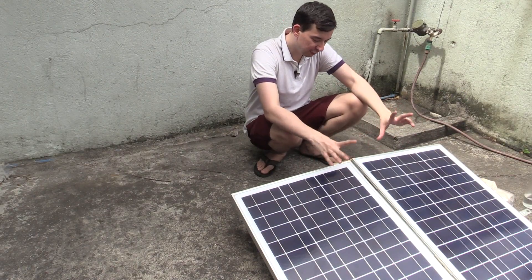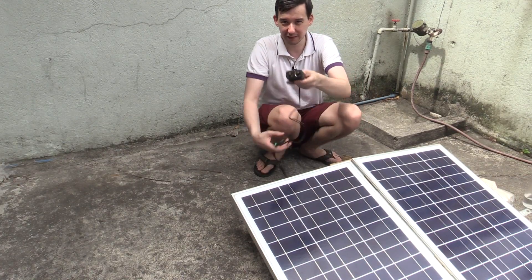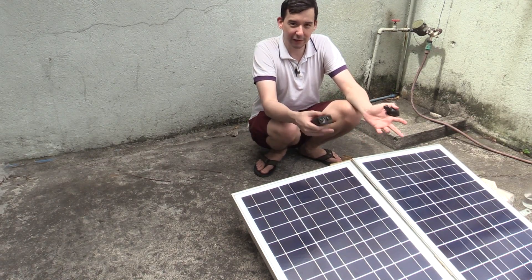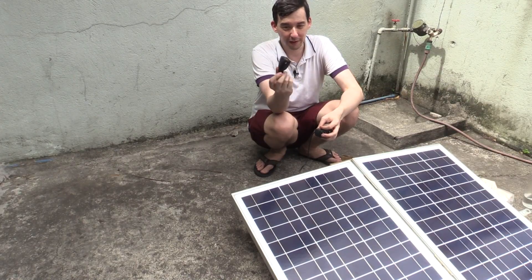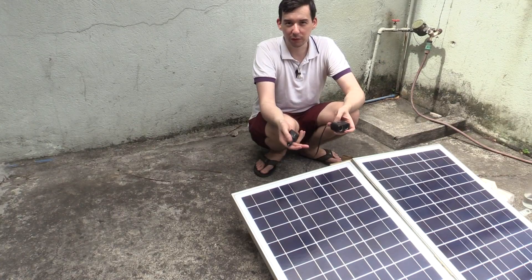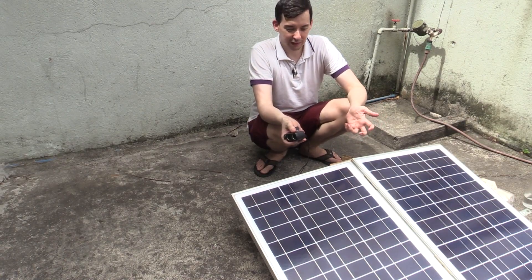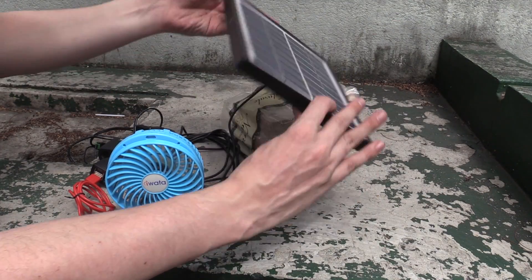That was a quick video and it's super basic — we've literally just taken two solar panels, put little connectors on them, connected a cigarette lighter socket, and we're using these USB adapters. Simple is good, especially if it's going to be used by people who aren't very electrically minded. You can go into any shop anywhere in the world and buy these things, so if they break they're easy to replace. There's other 12-volt stuff you could run from this too, like 12-volt fans — they'll run a little faster due to the higher voltage, but in an emergency situation that's okay.